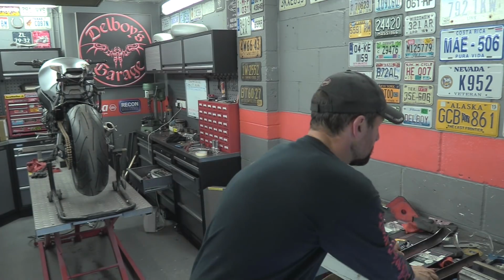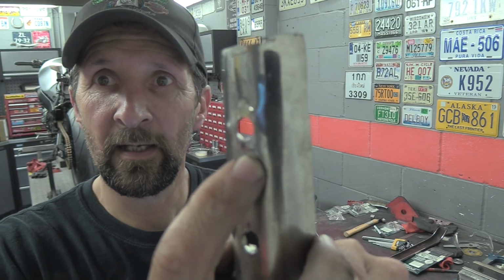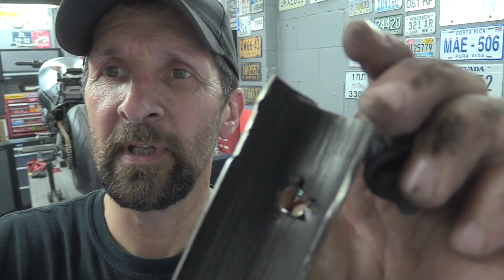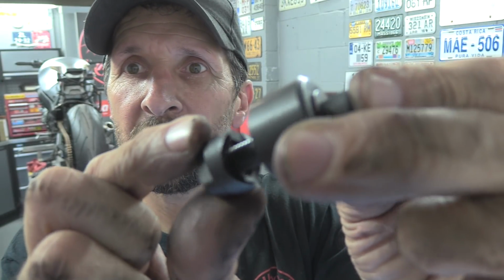But looking at how that one attempt of trying to get that 3/4 inch one through there has distorted that quite badly, and I wound that up until the Allen key actually stopped and was bending like a fishing rod, and not one of those, you see the little 3 dints there, that's what happens. I'll show you these if you didn't see the video. These are an amazing little tool. That's the little cutting thing there, and the 3 little points there, they cut through the sheet metal, punch through it, and then as you push them through, the curvature of the incisors goes through the metal and cuts it, but it's already distorting at that point.